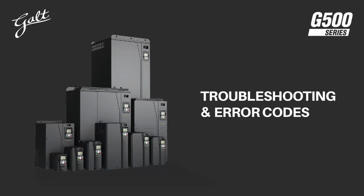First, you should write it down so that you remember what code it is before you reset the drive. Remember what happened when the drive tripped, for example, how long before it tripped, what speed did it trip at, things like that. And then you should check your parameter settings and wiring. So often, it is one of those two things. We've talked to many customers over and over, and very often, it is one of those two things. I know we often think we did it right, but let's double check it anyway.